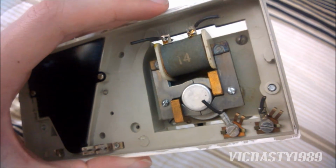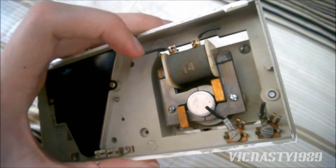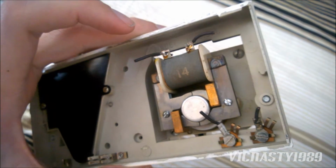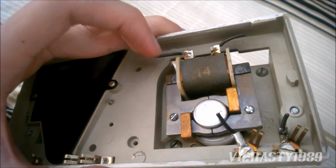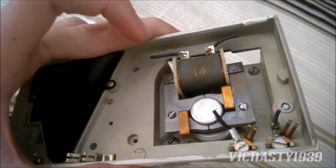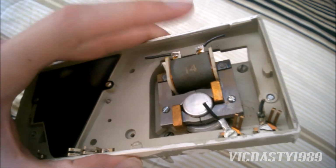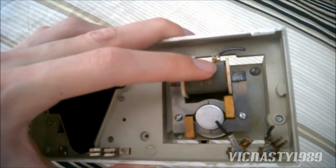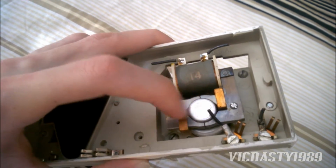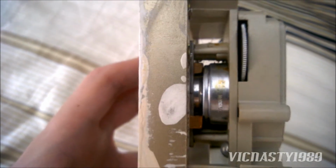Another interesting thing is my friend Colin, the technician that took this thermostat out, said it was actually 120 volt going to the electric clock motor. Which is very interesting because the other ones used a little battery actuated clock that ran off the 24 volt power running from the heating and air conditioning system. This one is actually wired separately into a legitimate looking electric clock motor. See it in there. It's like a little alarm clock motor.